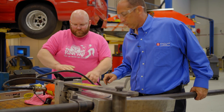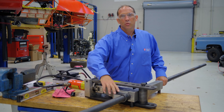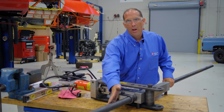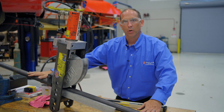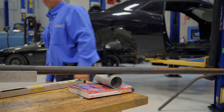The next step is we need to take out the slack between the actual follow bar and the roller. Now since we have a little bit of tension in our tube, we're going to stand the tubing bender up so we can measure our angle of what we're bending. We need to level this bar off so we can measure the angle of the tube that we're actually bending. So the next step is to put some shims underneath here and get this bar level.